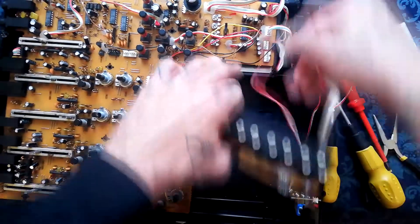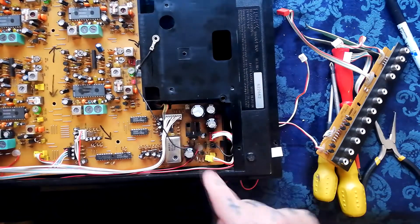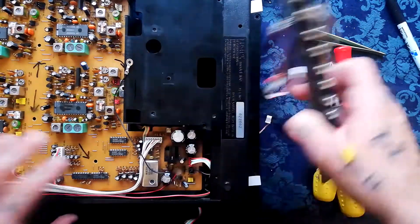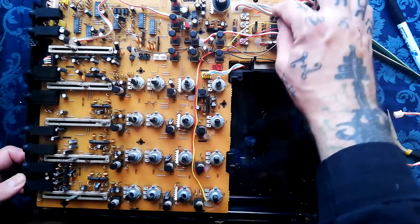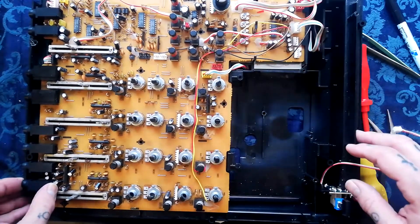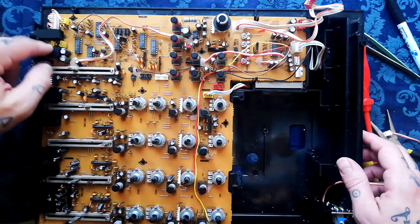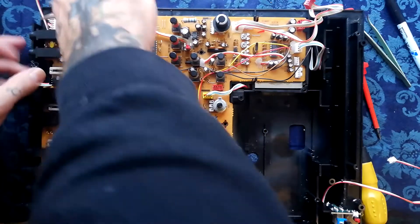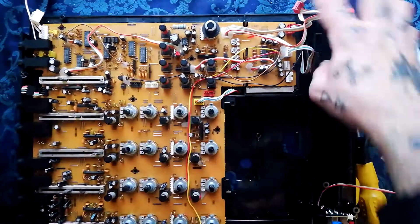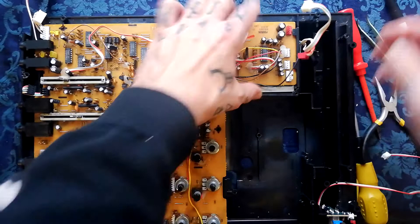Let's swipe around — output sockets. We're still left with this red and white cable here. Let's find out where that's going — and that is to a little two-pin yellow header there, which is a mute control apparently. At that point that's separate. With the remaining boards being the mixer — I've seen Tascam boards where they call it input amplifier rather than mixer, it's slightly confusing. At this end we've got three connecting cables: yellow two-pin, black four-pin, and white seven-pin. Then at this end there's two remaining — red four-pin and the tape one we already discussed.